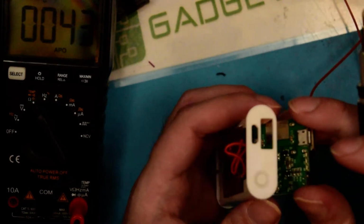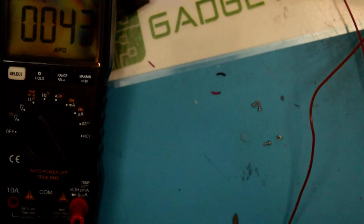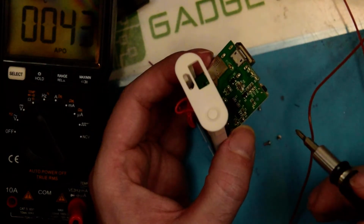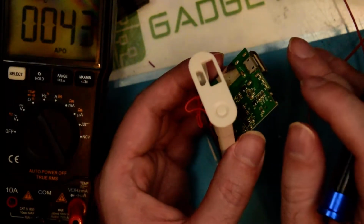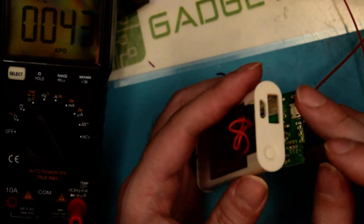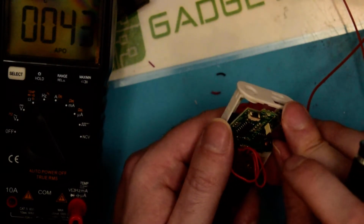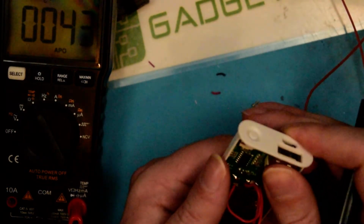It may just take advantage of this chip here, which I can't remember the designation of, but you see one of these in every single lithium battery pack in existence. It basically just says, okay, it's at 4.2 volts, we're going to cut it off. Oh, it's at 3-something volts, okay, we're going to cut it off. And it uses the MOSFET packages to accomplish that. We got the little button to turn it on and off. And yeah, that's actually a surprisingly robust and well-built little thing.